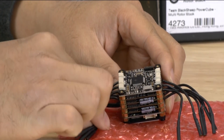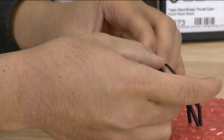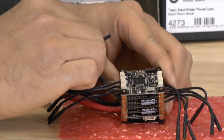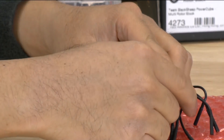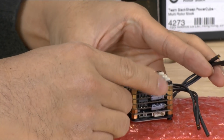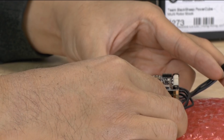Alternating the ESCs makes a lot of sense because you'll plug this one in on this side. ESC2's plugs are over here so you'll plug that one on that side. Then 3 is back here — this one goes to the back left — and then the last ESC goes to the front left. So essentially by alternating them, the plugs are all going in the proper direction.